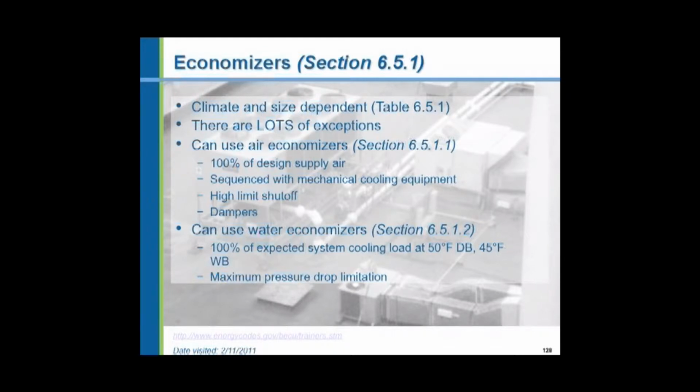The only consideration is, would you rather have return air or would you rather have fresh air in your building? So between 55 and 75, you want to go to full outside air. That's what the economizer does. Below 55, you return to the minimum settings required for ventilation in the building as set by the ASHRAE Standard 62. And above 75, you return to the minimum settings as well. There's only one exception to that, and that's humidity.